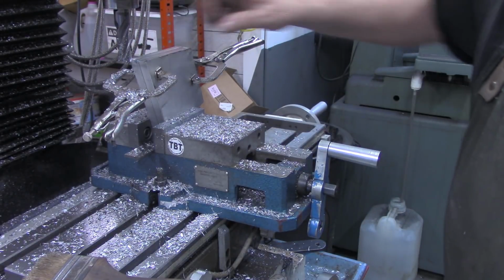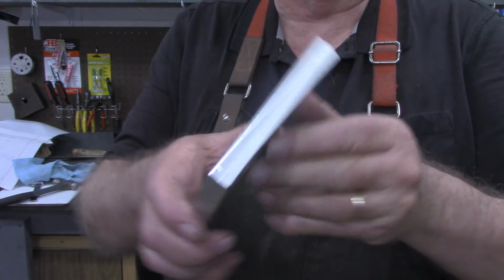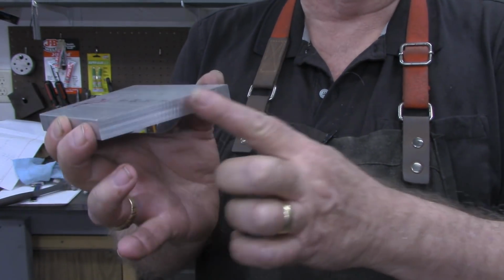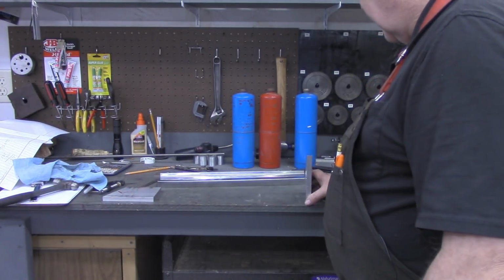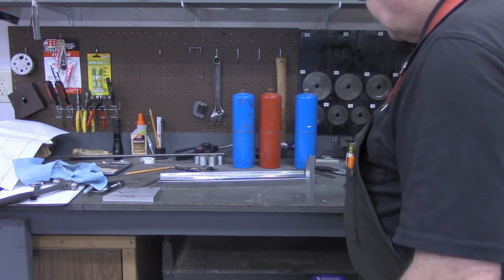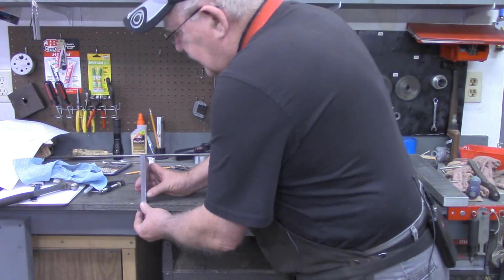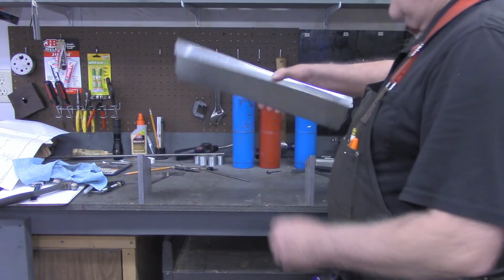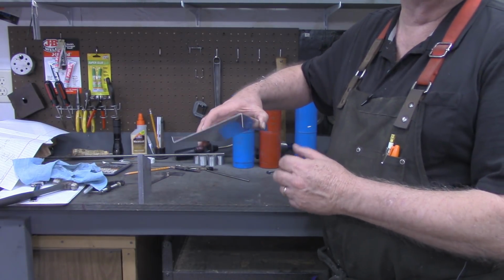All right, I'm going to swing the camera around to the workbench and show you where we are so far. All right, we got a good clean finish on our 20-degree bevel here. Good finish on the square end. I've marked these left and right now because I'm fixing to mark some mounting holes. And I got me a couple little cheater marks on the table there just to get this set up. I'll try to get out of the way. But now, hopefully you can see why I wanted this fold 20 degrees beyond 90.